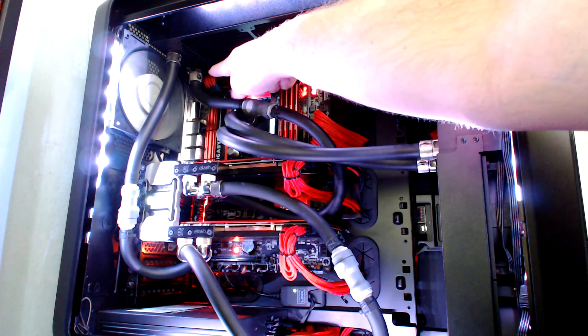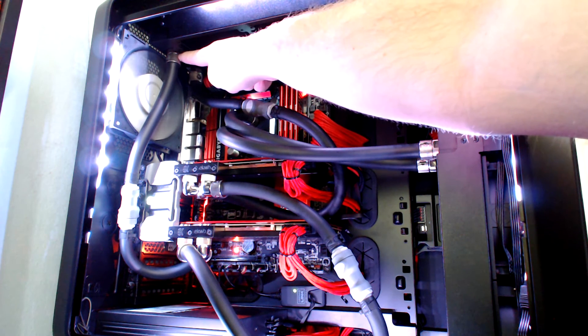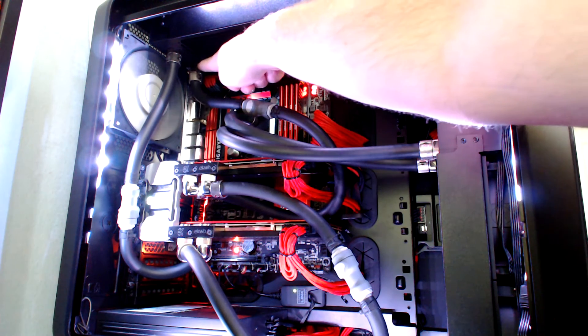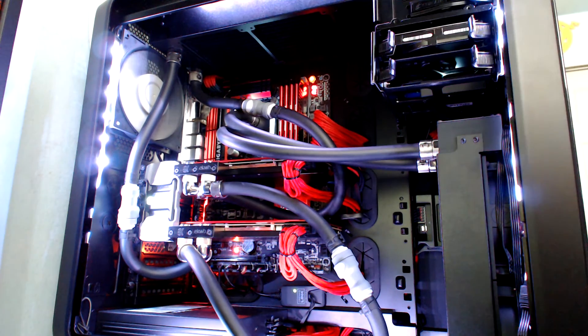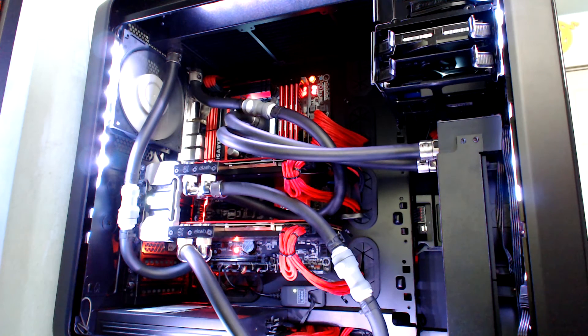The first one I got — where the threading goes to the pump — it's made out of plastic, as opposed to the end tank side which is actual metal. I think in the manufacturing process it over-tightened the rotary compression fitting, because it's done with a wrench, and it actually stripped the plastic threads on the DC pump. So it was leaking. Glad I didn't put it in yet — that's something to be aware of.